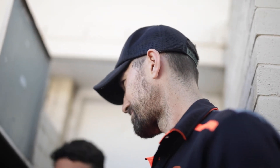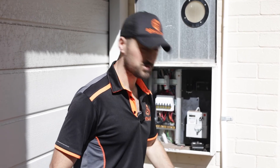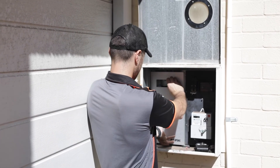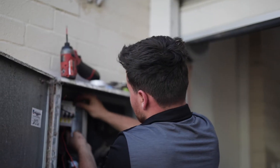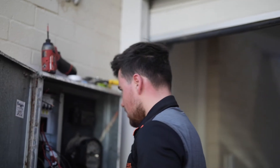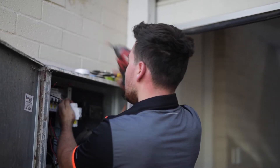Alright, I already finished one — five to go, and I wasn't even trying hard! So we've got the first one ready to go. We're not quite ready to test yet because we need to switch on the power for the whole complex to test the switchboard, but it's looking much better with the cover. Just connecting in the circuits to the RCBOs now — a bit tight with all these cables everywhere. Then I'll do the loops off the main switch, finish off the neutrals and earths, and get it powered up.